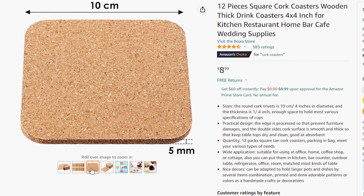I know these coasters are truly square as I've measured them before, but I forget the exact size, so I used a digital caliper to get an accurate measurement — they're approximately 3.92 inches. By the way, if you don't use a caliper, get one; they're really cheap and so much easier than working with a ruler. We do most of our laser layout work in CorelDRAW, so that's what I used here. The canvas was already sized to our default 40 by 24 inches, which is the bed size of our Trotec Speedy 400 lasers.